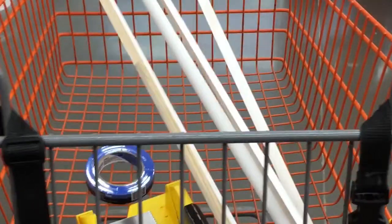So I went to Home Depot and I bought 11/16 quarter round because we thought that was the biggest gap, but it wasn't. So I got the quarter round and I went to just do like a test, and it just fell right into one of the gaps because it wasn't wide enough. So I ultimately had to get 3/4 inch. So my tip here is just measure all of your gaps to make sure that you get the right molding to cover your biggest gap.